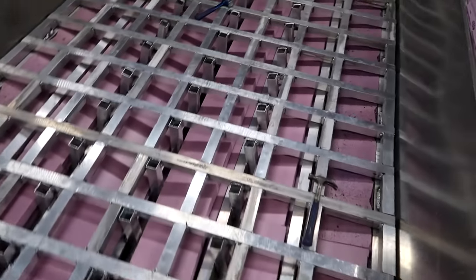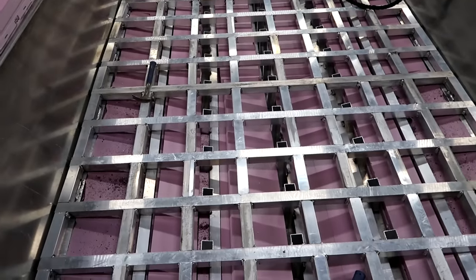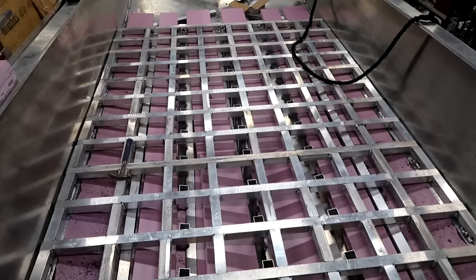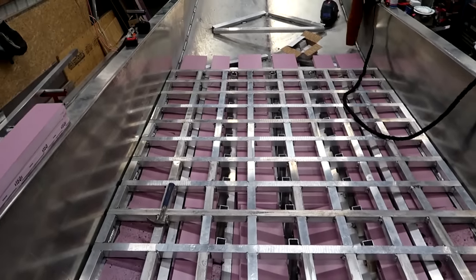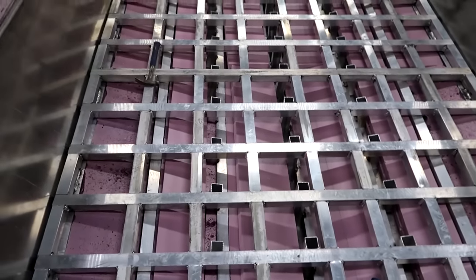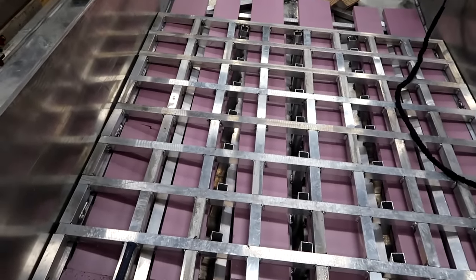You can see here — a lot of work on this subfloor. Like I said, this is all 10 inch on center two by two square tubing. Some of you guys are going to say why couldn't you go 16s or 12s — well, this boat is going to be beating through big waves for the rest of its life, it's a long boat, why not spend a little extra time and make it real beefy. I've got uprights welded into the side of the boat, 10 inches on center, everything welded 100% on two sides. You could set a semi on this and I don't think it'd flex too much.